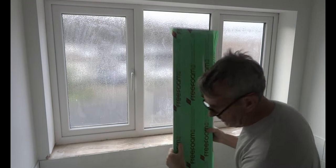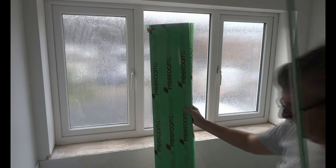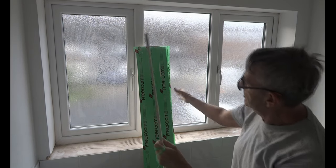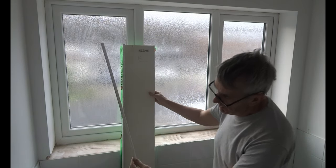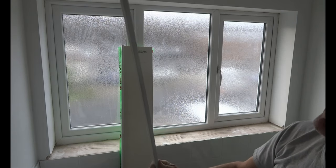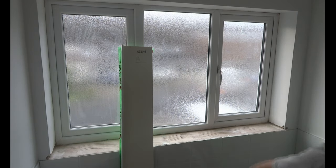Okay. Back in a minute. Right, there's the cut made. Where's the other piece? Cut the piece off it. And as you can see from that, I cut this from the inside, the underside. I cut it with a circular saw, so I cut it from the inside, so it doesn't chip the material. If you can see that, putting that there. No chipping on the material because it cuts from back to front. Anyway, that bit of scrap.